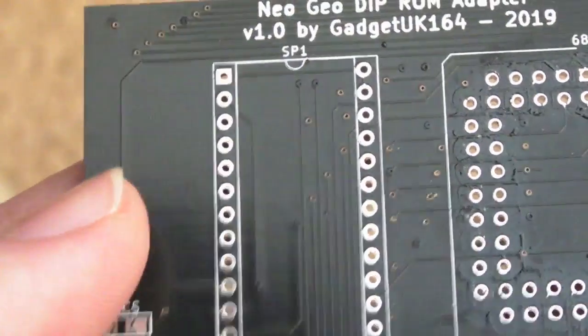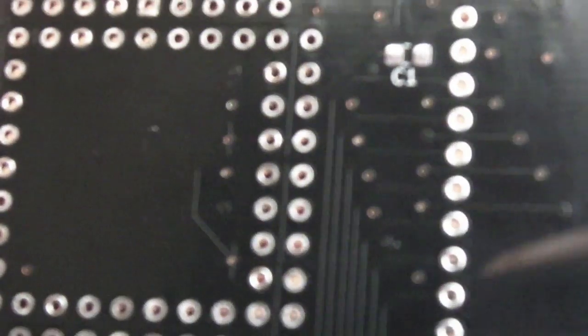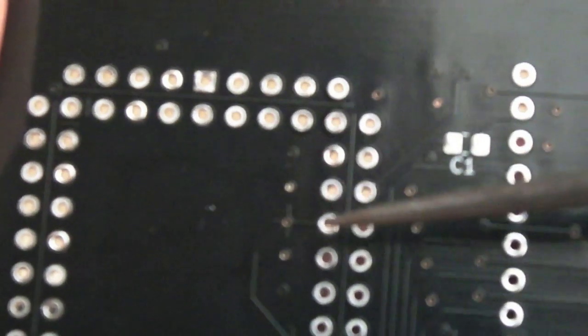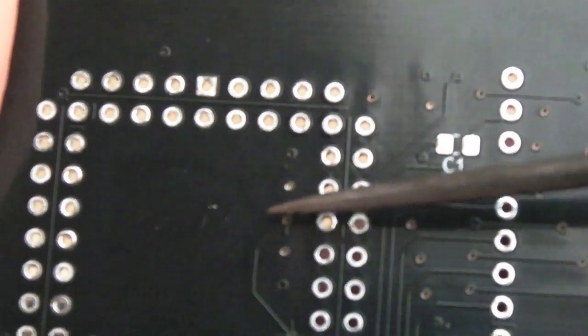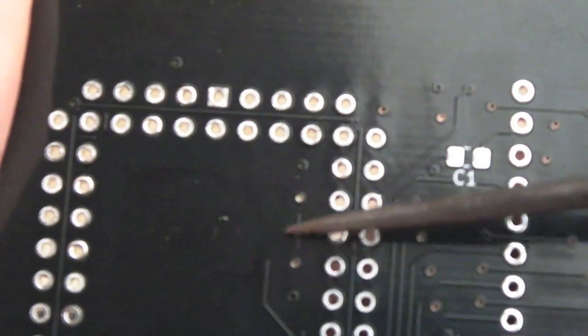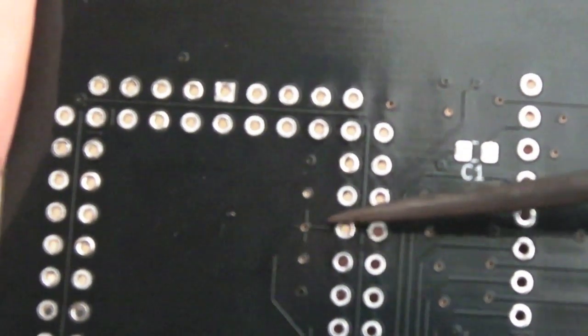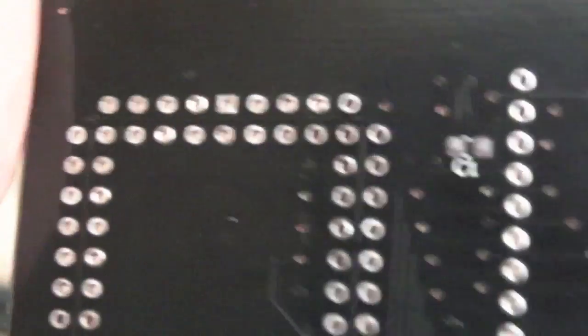That's not what I wanted, which of course means, and it might be more evident on this side here, where there were grounds. Can you see this? This is where I had a bit of a fudgy attempt. This was all ground around here, and this was a ground pin, and can you see it's coming out here, and that's where it was joined up. There was a circle here where it had not filled it, and it was joining this pin here to the vias and the ground area, but that just looks a mess actually.